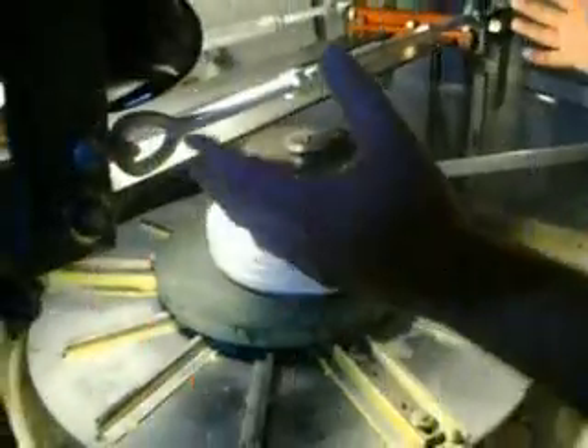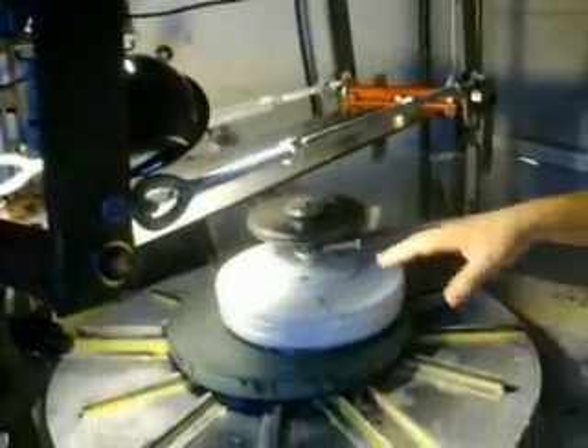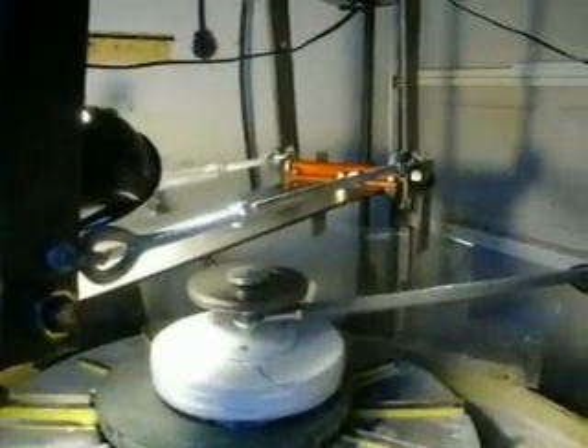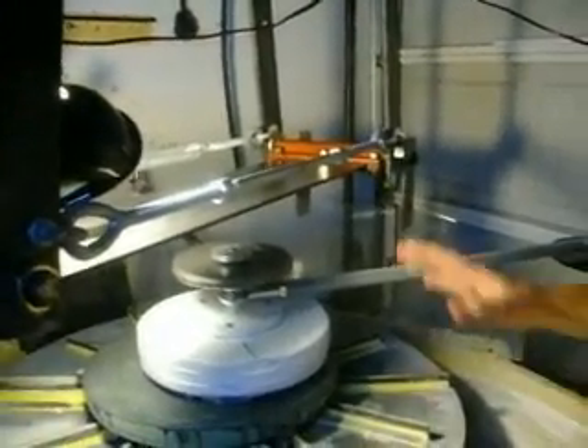This is the diamond curve generating machine up here. I actually just use this chain to crank it up and get it out of the way, and I can do the grinding. So it's a multi-purpose machine. When I get into the finer stages, I'm going to wrap plastic around this, because it's got much junk on it. But this is just coarse grinding, so it's a little easier.